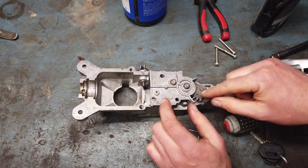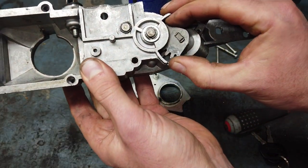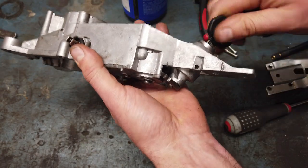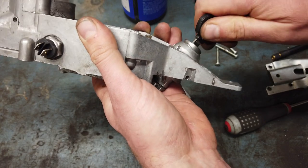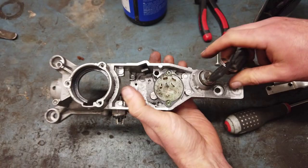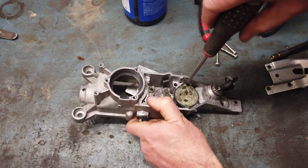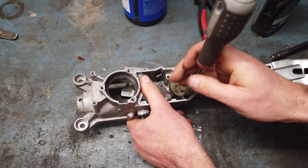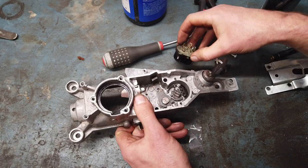This is the one that I could turn with the screwdriver, this down here, and put it in and out of ignition. This does not seem to work together with this. I think it's something internal in the barrel that is broken then. I'm just going to take this one out as well to find out how it's connected together with the reverse gear. At the moment, I think it's the barrel that is the problem. Maybe I could just swap that, but... Oh yeah.